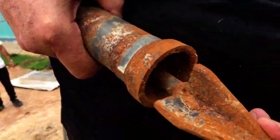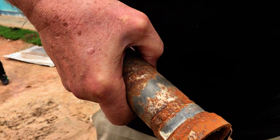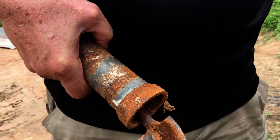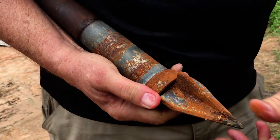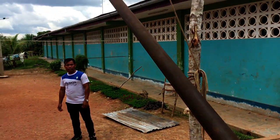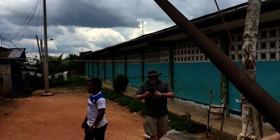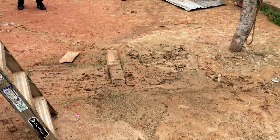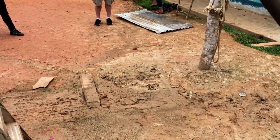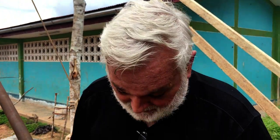Back up in here is a check valve. When you pull this pipe up, the check valve is closed and the fluid in the pipe will not come back down and run out. But when you jam it down on the bottom, the check valve opens and the fluid gets pushed up into the pipe. The flow actually comes out of that piece of PVC. We dig a mud pit right next to the hole with a little channel, the cuttings settle in the mud pit, and the drilling fluid runs back into the hole around the outside of the drill pipe. It's a reverse flow — we don't have a mud pump, so we reverse flow it with a check valve.